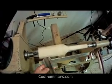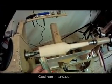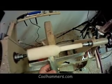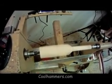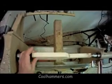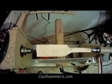We don't rough down in the normal sense. On the blade, I like the handle to be centered on the blade. So when I rough the blade down, all I'm really trying to do is to get the sides parallel to one another. When I turn the handle, sometimes I turn it straight and plain, sometimes I make it fancy, sometimes I use a wire burner to add accents. Just depends on how I feel and how many of these I've made and what I've done recently.